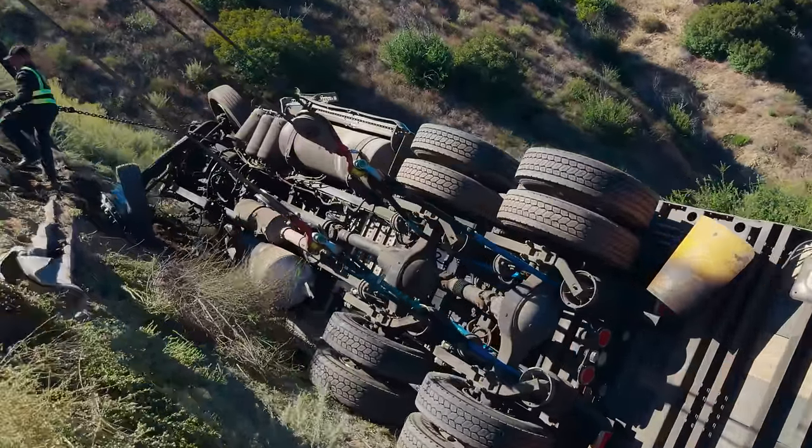Ricardo's just gonna pull in with this truck to get the front end more straight. This is just one of Alex's lines. Go in on the load cell line. Look how fast these numbers jump. From 10,000 to 22,000 in a second easily. That's why you always over rig.